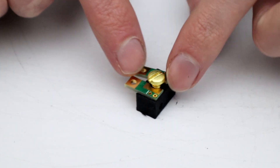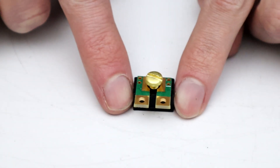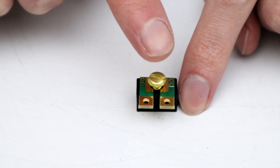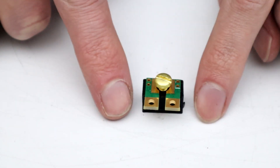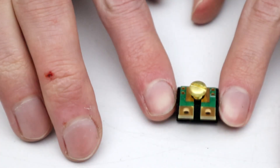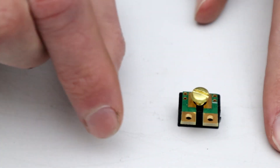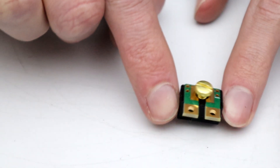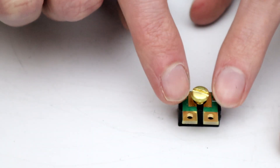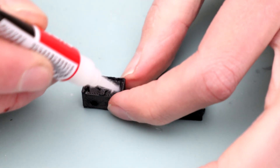What I like about this is that when the switch is powered off, the bolt is only contacting the TPU block — it's not actually contacting either PCB — which means the screw is not live when the robot is off. It can be a problem with the Finger Tech switch if you wire it in back to front; if you mess it up, your bolt is alive all the time, and when you put an Allen key in that Allen key is alive and can short things out. I also want a little top plate just to cover these pads a bit better and make it so when the bolt is raised up you can't really see anything other than the output section.